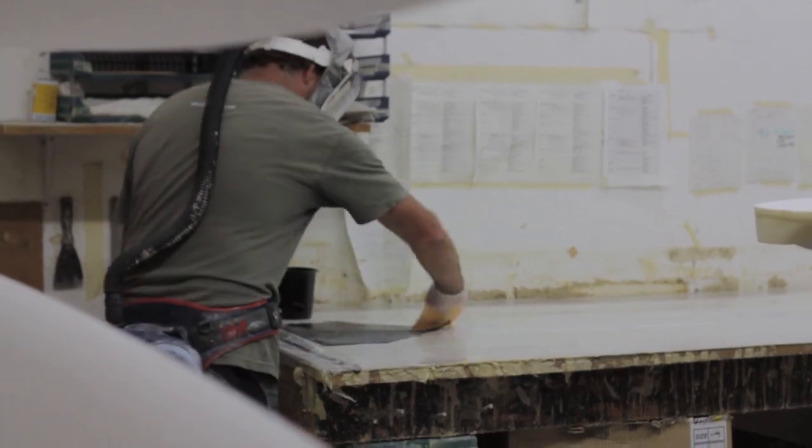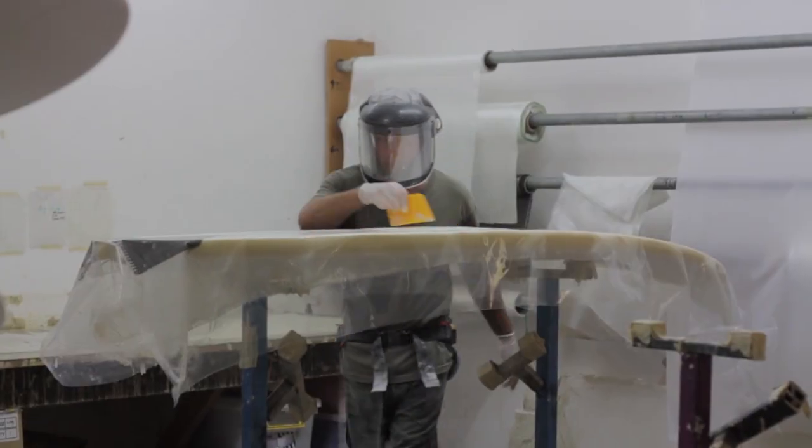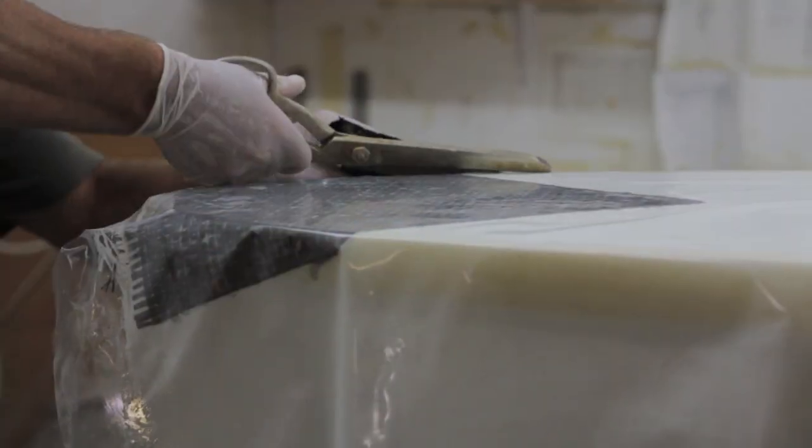We add an epoxy resin with a foaming additive to get a better bond between the two foam surfaces, because if you imagine, if you blur those up, they're quite coarse, they're not that smooth, and so that allows the resin to expand and really lock into these two structures and bring them together with a laminate in between them.